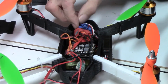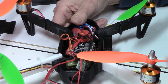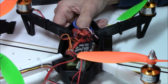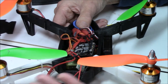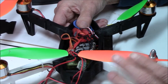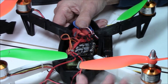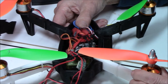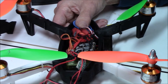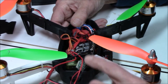There are a lot of files up there, and I tried to make the print files pragmatic for what you're actually going to be flying rather than some idealized product. These arms are designed to work with an 8x4 prop, which gives a bit of clearance between the props. The original model didn't quite work with the props I had. The great thing about 3D printing is you can adjust any dimensions to fit whatever product you have in stock.